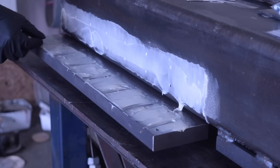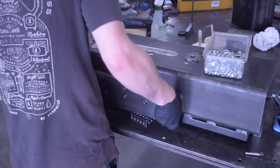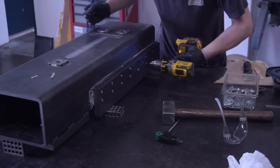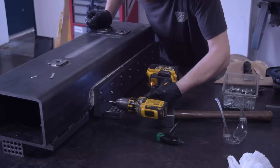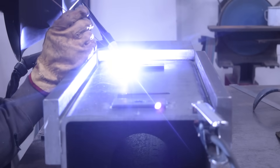I added shims to the joints to make sure there was a place for the epoxy to live once I'd tightened all the bolts down. The irony of drilling and hand tapping all those holes after that preamble is not lost on me. And would you look at that — those pads look like they'll be the perfect spot for the ball screw.